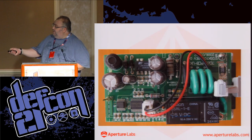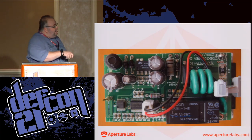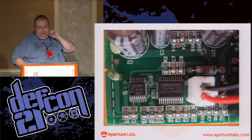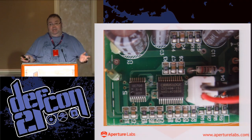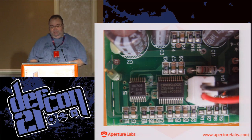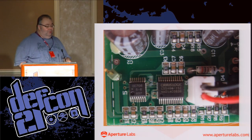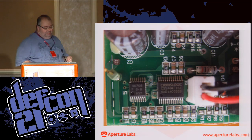On the top here you have a little power supply. The next important thing is this resistor here, resistor 17, which is to measure the current. So here are the actual important bits. We have two chips here. A Cirrus Logic chip, which is nice and clearly marked. Cirrus Logic is the vendor. It's a CS5466-ISZ. Type that into Google and you'll get the data sheet and you're off. And then we've got the OC706, or if you look at the other plug, it's the OC708. Can't find anything about this device.